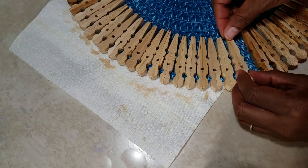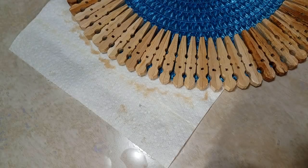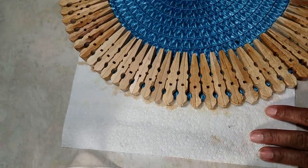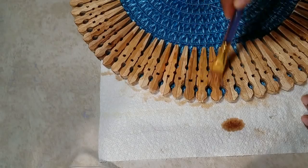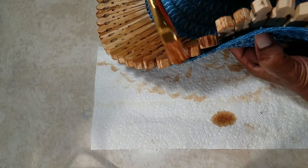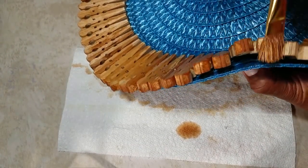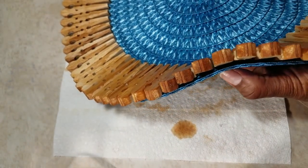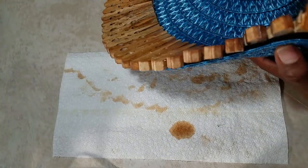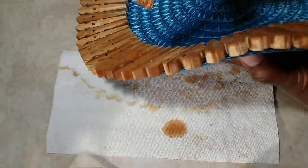I stained the project as I went around — stopping to apply stain, with just a paper towel underneath. The application was so light I didn't make a mess at all. I lifted up the edges to apply stain around the edge, and it was very simple. You could whitewash at this point using a paintbrush, or whatever you want to give it a pop of color. Wood is porous, so as soon as you apply your finish it's being absorbed — you don't need to put on a lot.